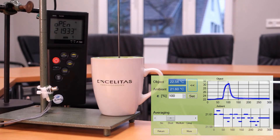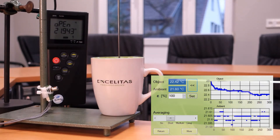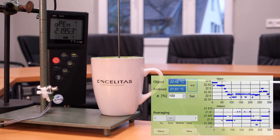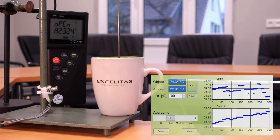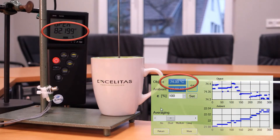When the cup is at the same temperature as the ambient, I expect the object and ambient temperature to be the same as the temperature of the probe. In this experiment I see a deviation of 1 degree C. I fill the cup with boiling hot water. Before I can make an observation I wait until I see both readings decreasing — the cup does not warm up anymore. The deviation is about 10 degrees C.